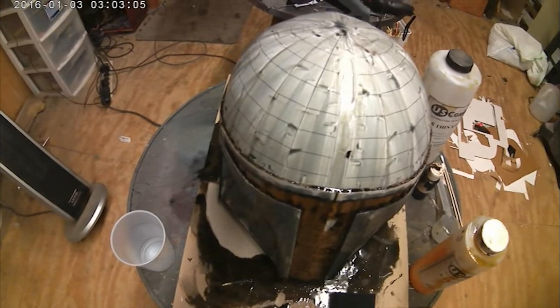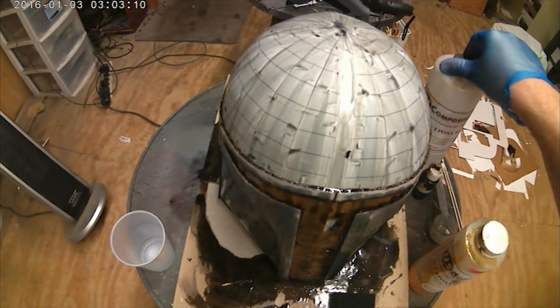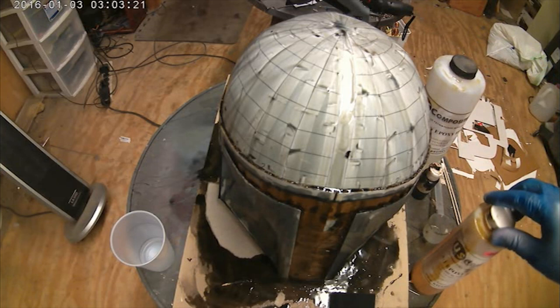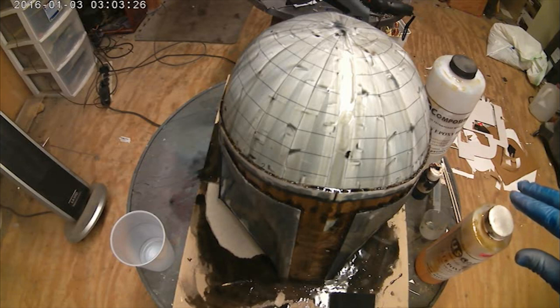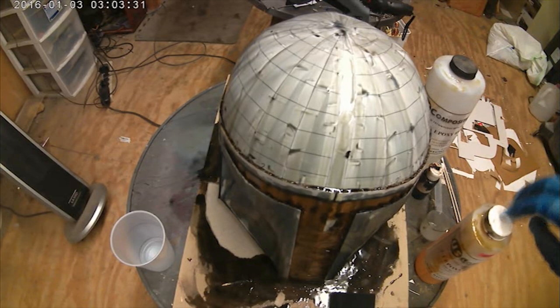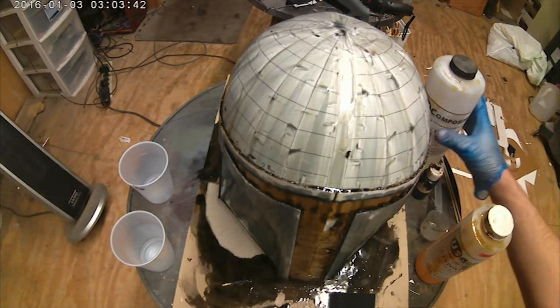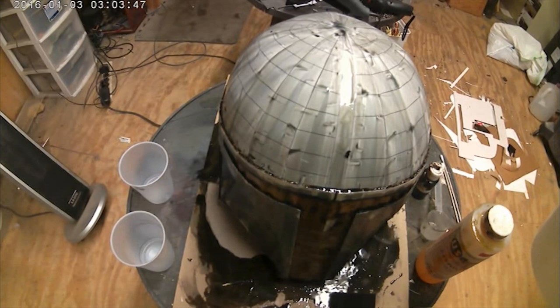And so with the epoxy, you've got your part A and your part B. You want to make sure that you mix the epoxy appropriately. There will be directions that come with your epoxy resin on the ratio in which you need to mix it. It'll be either a 1-to-1, a 2-to-1, or a 3-to-1, depending on the viscosity of the epoxy itself. I've used this particular type of epoxy in several different applications. So we're going to go ahead and measure out our part A and our part B now.